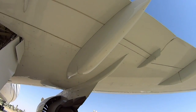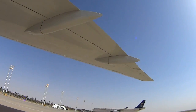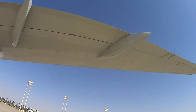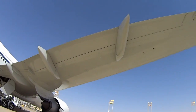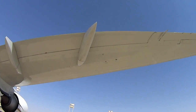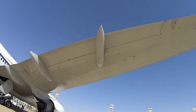Take a look at the trailing edge of the wing — make sure everything's in order. No major leaks or anything. We do get static leaks because we park for a long time, so those little streaks are just small static leaks that drip down. They're not a concern at this point when they're at that small a quantity.